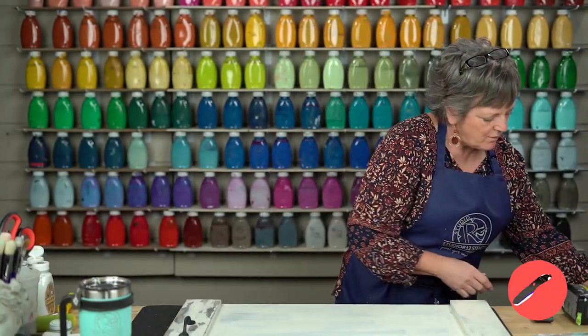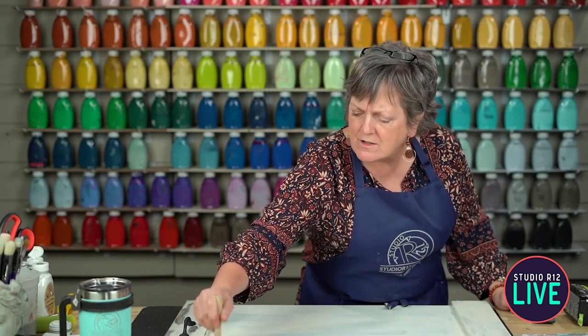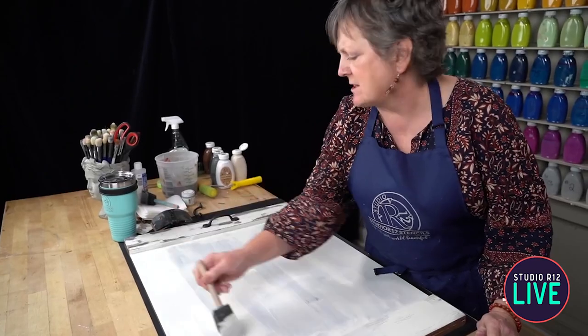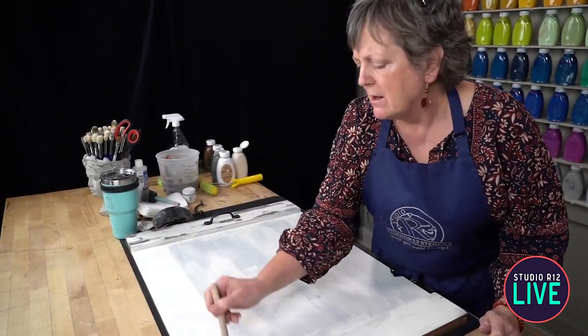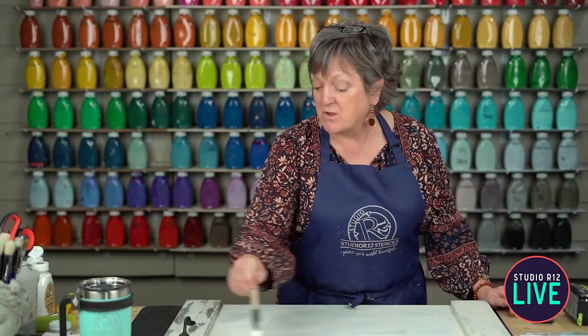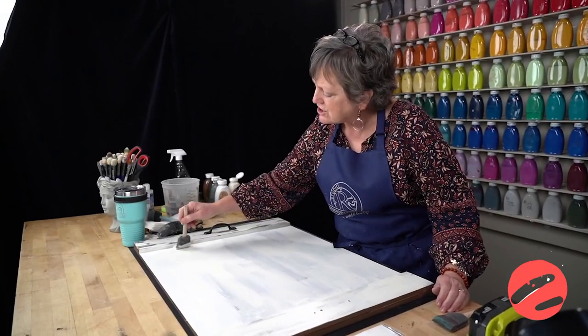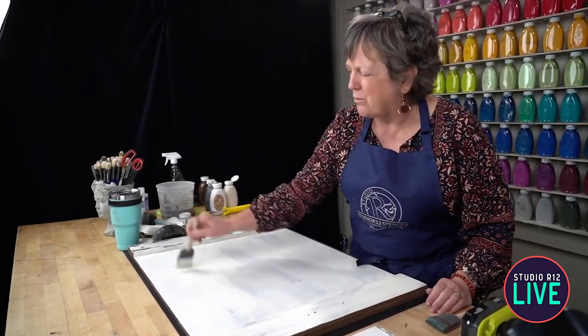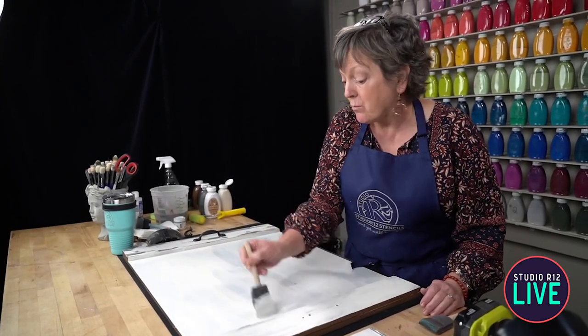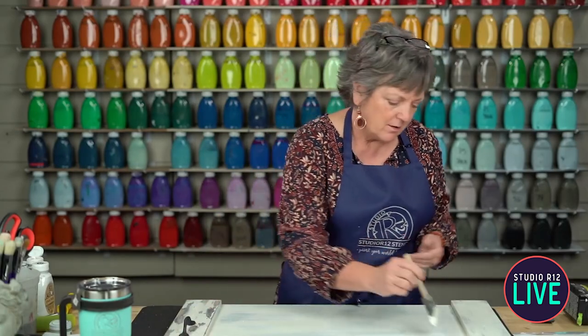When we were doing some of the background things, I'm trying to be a little better about working ahead. I had my boards prepped and we're doing different backgrounds throughout filming. I worked so far ahead that my paint was so cured I almost couldn't chip at it with my sander. I would have had to move to an electric sander. So when you're doing these chippy backgrounds, you want your paint to be fresher. Don't work too far ahead, because then your paint won't chip and gouge out, like this beautiful thing over here.